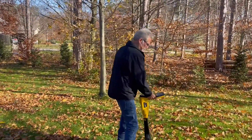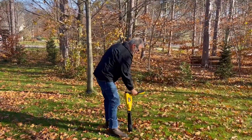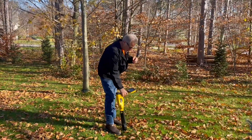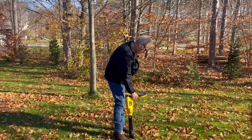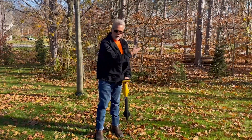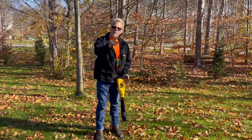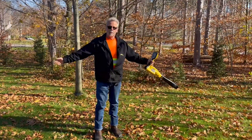Right off scale — here's the gas line in the same place we had it before, but a much weaker signal. In fact, I'm not really getting a good strong signal at all. I'm not getting any kind of peak and null. I'm certainly getting a signal, but I'm down to 0.08, or less than 1 milliamp of current. So by moving my ground return point to that side, I'm now almost eliminating this as a return path, which means that this field now isn't interfering with that field — in fact, that field's interfering with this one. It takes this right out of the picture. These are the techniques people use to eliminate or reduce distortion and get more accurate locations.